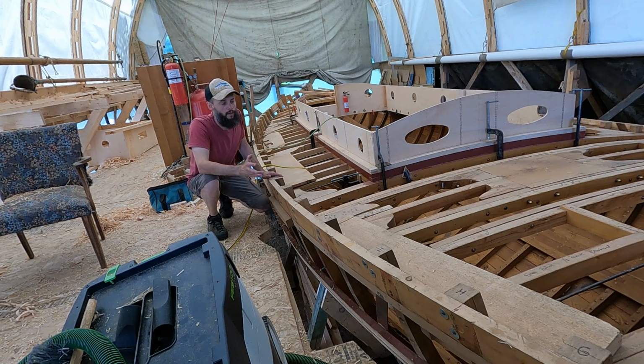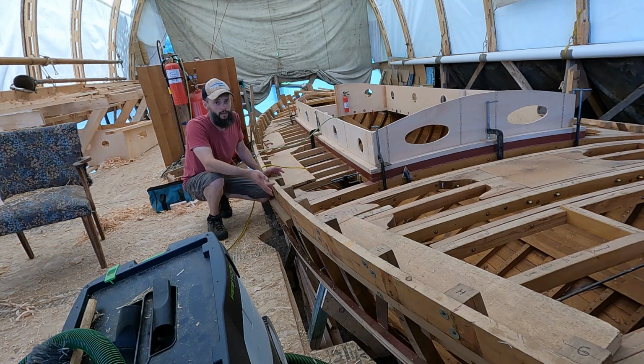Those three planks, the only thing they stop us from doing is putting on the deck and finishing up the hull. And doing the deck and fairing and caulking the hull are two things that we want to do at the very last minute. If we were to caulk the hull now, we're going to go through at least another summer and at least another winter, and those planks are going to swell and shrink, and that cotton's all going to loosen up, and we're going to have to harden it all up, or re-caulk it before launch.